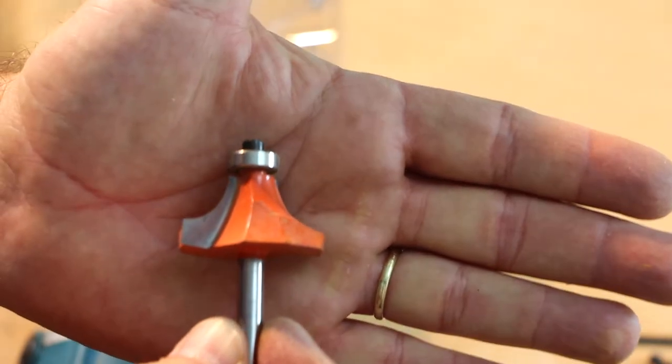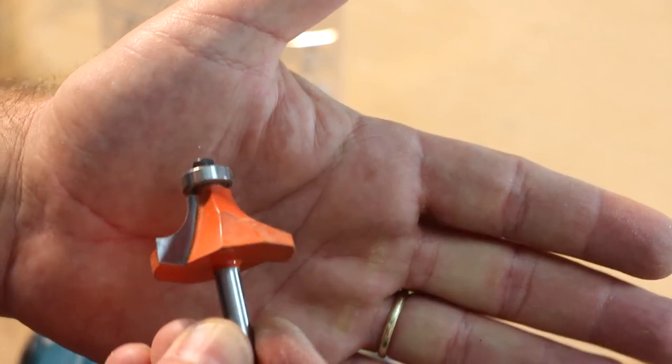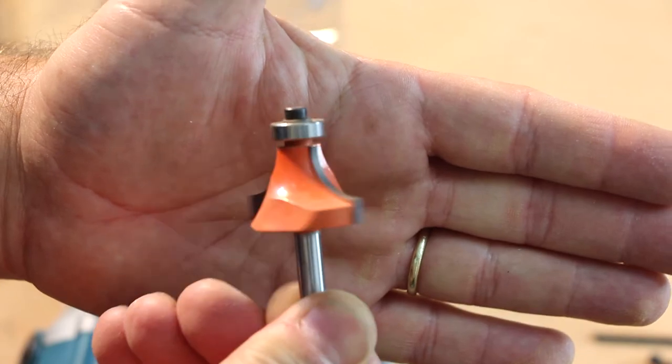The second bit I'm going to talk about has a slightly larger diameter of about half an inch or 12 millimeters. If you're a Stratocaster fan, this one is a must-have. After you've cut out the shape of the body and properly sanded the outline edge, this bit will give you the roundness for the majority of the body. You'll still need to sculpt the elbow area and the belly cutout, but this will take care of the wrist. You do need to be careful around the neck pocket. Some older models actually use a 7/16th radius bit, but the difference is minute.